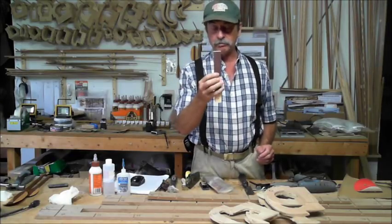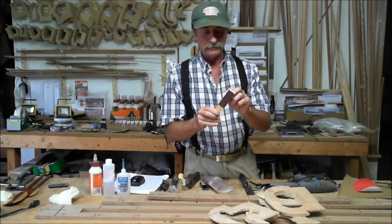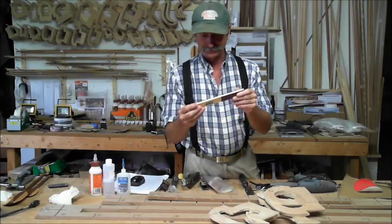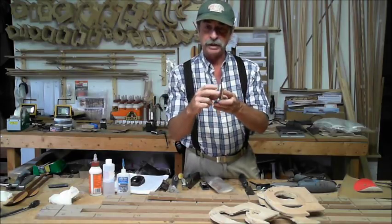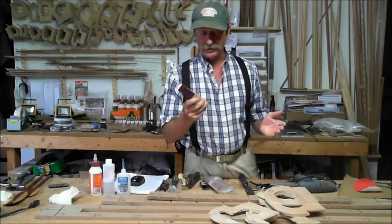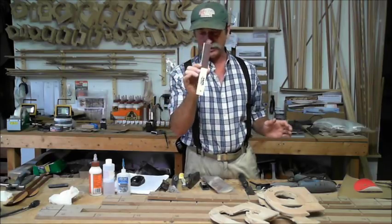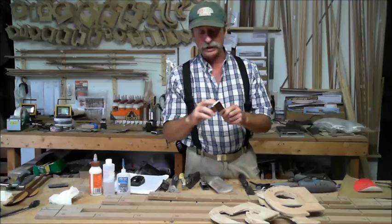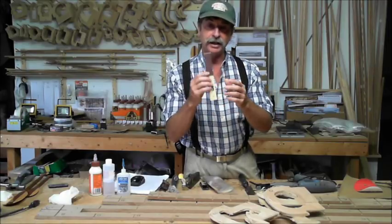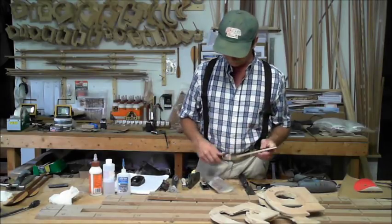All the kits, usually I put in a sanding stick. It's usually a promotion. If you get one, that's good. If not, you can make one. It's basically a piece of wood with some heavy sandpaper glued to it. These are great because they're flat, they're inexpensive, and you can make a nice straight sanding surface. A sanding stick. Like I said, you can make these for very little money. I actually use belt sanding belts cut up, and then I hot glue them to this. But you can use any kind of glue and any kind of sandpaper. Toss them when they're done.